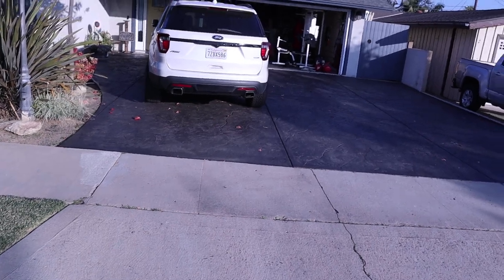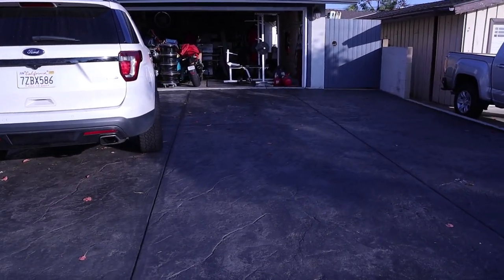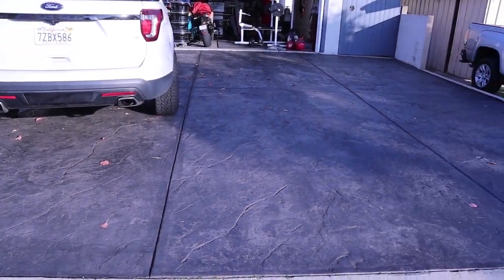That's one last thing on our list that we want to do before we sell this place and get the top dollar we possibly can so we can escape California. When we did this driveway, it originally was an asphalt driveway — we tore that out and put in this cement driveway. Before the concrete was dry, they had these about three-foot diameter rubber stamps, and they put these big chunks of rubber down that had the texture of slate and used big stomper plates to imprint the texture into the driveway. That's the texture you can see. Now, there are a couple different techniques for using color on stamped concrete — I'm going to show you a couple of those right now.